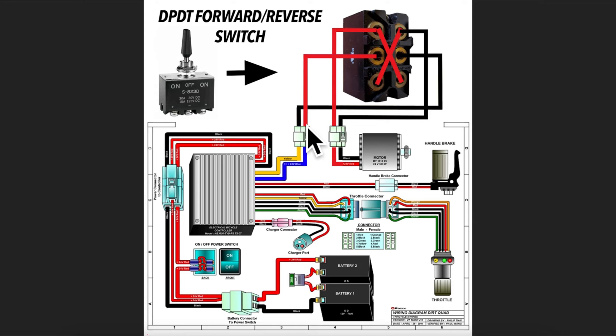Follow the same electrical setup shown here. Wire yellow to black, blue to red, red to red on the motor side, and black to black on the motor side. Then follow the same outline on the back of the switch. The X markings are in red wiring - you can use red or black wiring, it does not matter. This is an on-off-on switch rated at 30 amp 30 volt DC. These switches are very hard to find so please use with caution.